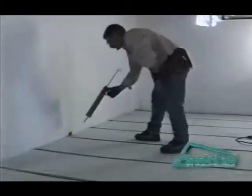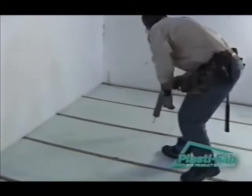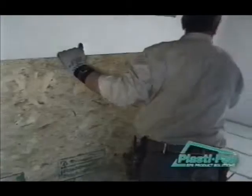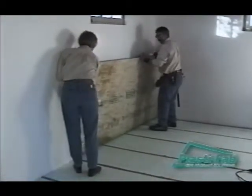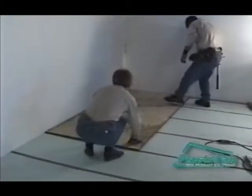Apply adhesive to the strapping. Be sure to ask your local building supply professional for advice on choosing the subflooring best suited to your application. Most likely you'll choose a 5/8-inch subfloor-grade plywood or oriented strand board. In this video, we will use 5/8-inch tongue-and-groove oriented strand board. Then fasten the subfloor directly to the 2x2-inch strapping using either ringed nails or deck screws every 8 inches. An automated nailer, screw gun, or stand-up subfloor screw gun can be used.